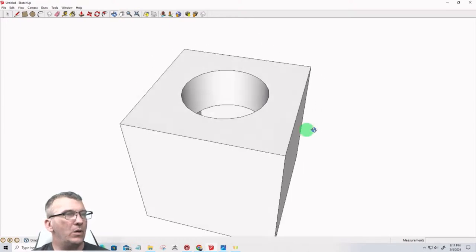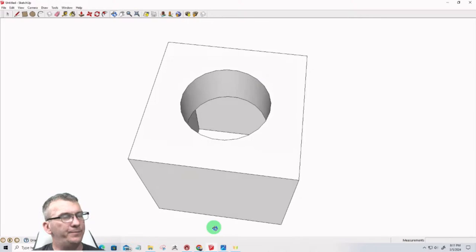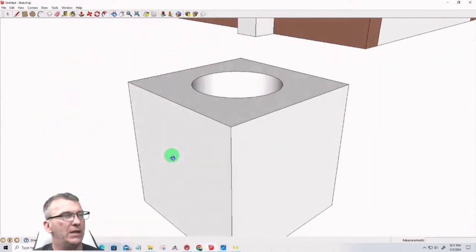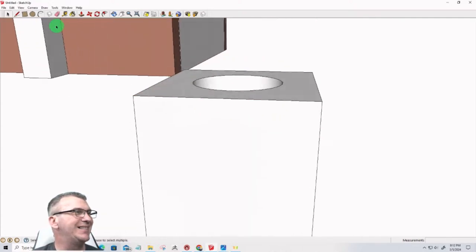Now, on the side, they have a nut. It's not a real threaded insert. It's just a nut. I'm going to be making this cap out of walnut. And this wall thickness is 1/4 inch. I think I'm just going to epoxy a 1/4-20 nut in there, and I'll create the recess or the pocket for the nut.